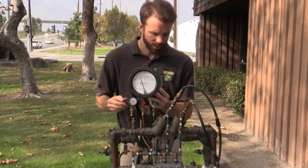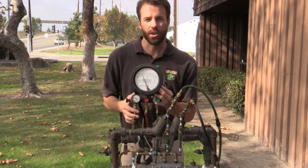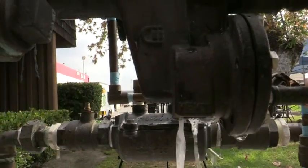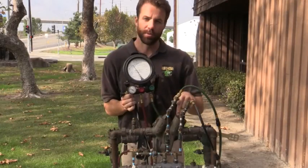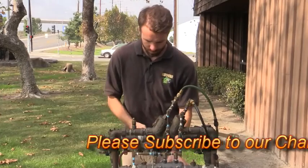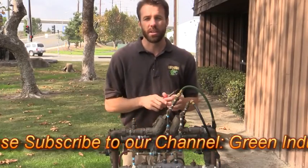One full turn here. And you can see I dropped to my relief valve opening point — I'm getting discharge. That means that my number 2 check valve is not holding tight with back pressure, and we failed the number 2 check. What you want to do is remove your equipment. You're going to need to make repairs before you can move on.